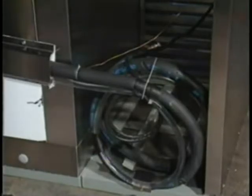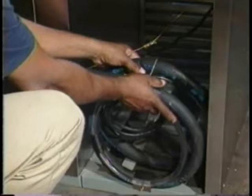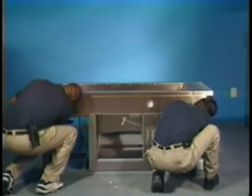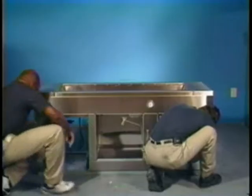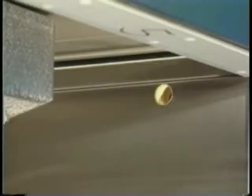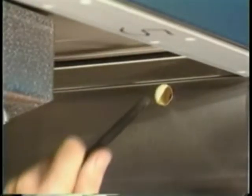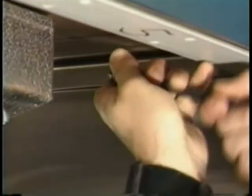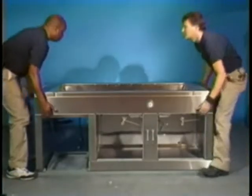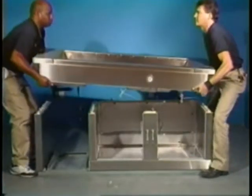Slide the refrigeration line set out of the storage compartment and remove it to a safe place. Using the cam lock wrench, a ⅜ inch Allen wrench, start on the left end in the refrigeration compartment and loosen the cam lock located on the top of the left end. Then, going into the cabinet, beginning on the upper right-hand side, loosen all cam locks that connect the top to the ends and back. Now remove the cam locks on the center mullion. With one person positioned on each end, pick the top straight up.